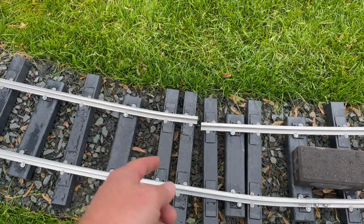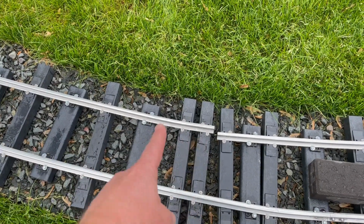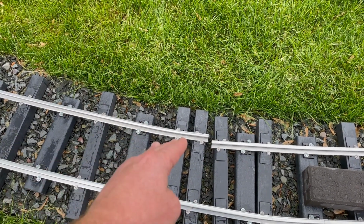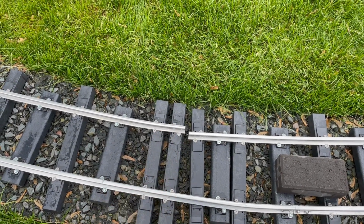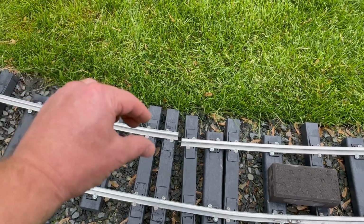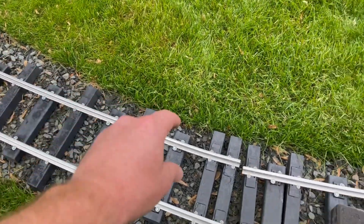Now, a couple of people have said, get your turn, and if you did it with your homemade rail bender, then chop off the ends, and then you're more likely to have that continuous curve through the end of your rail. Another thing I did is, with the rail bender that we had, I bought some metal wheels, and I attempted to just keep pinching it towards the end just to get the ends done and not even worry about the middles, because you can get a pretty good curve with those.